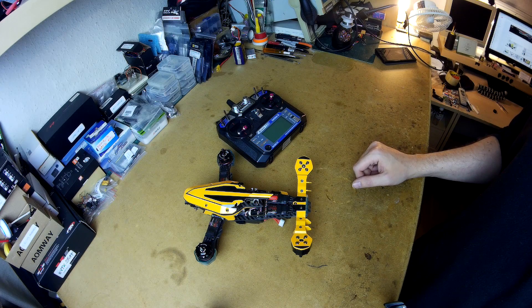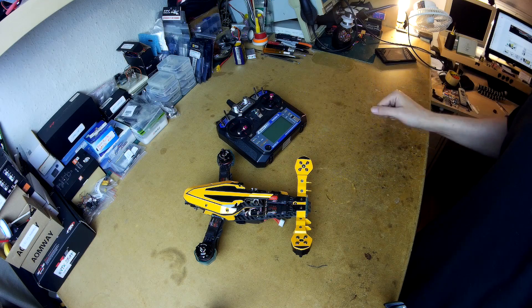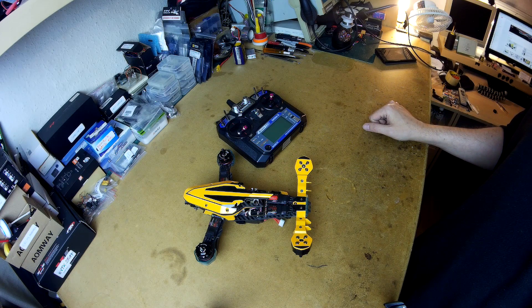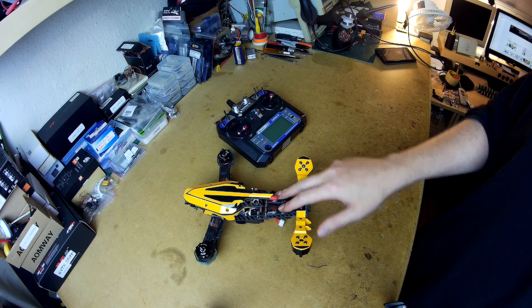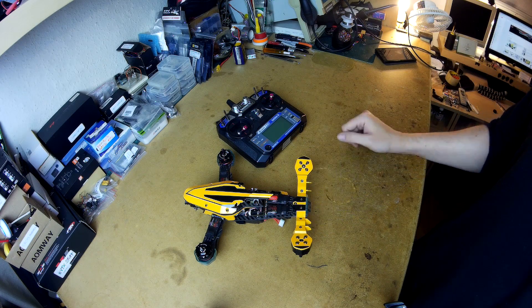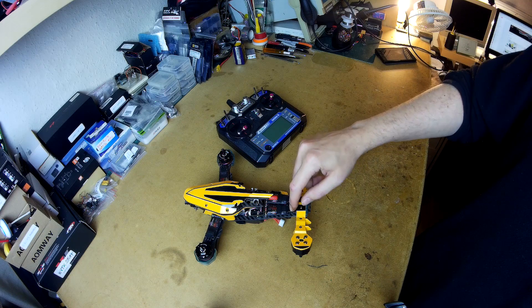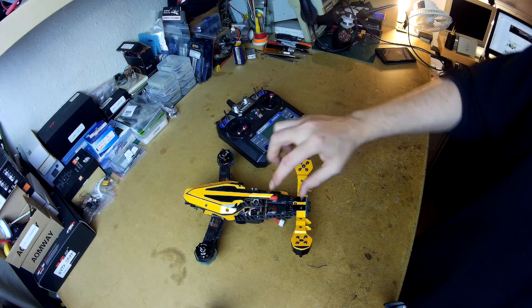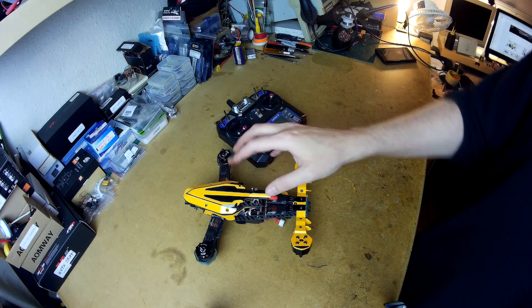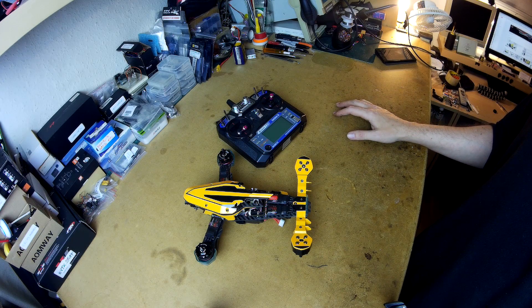Something I might look at, but with this ESC dead I'm going to need an ESC as well. You can mod these — it's basically the same blade connectors as the F210. I wasn't massively fond of those ESCs but they performed fine. There are 2mm bullets on here, so if you want to swap them out you're basically going to be soldering in new ESCs, and you'll probably have to put a new flight controller in there too to guarantee you won't get any vibe issues.